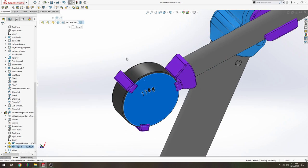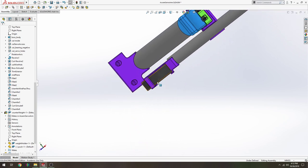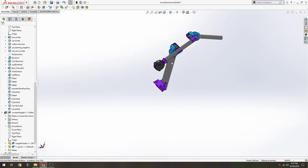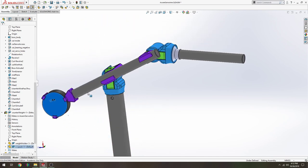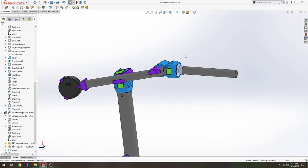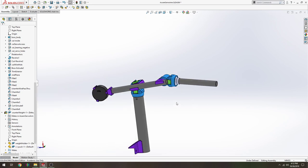And the hockey puck, standard hockey puck, is 170 grams, and you could make this taller. You can stack more of them, 1, 2, 3, 4, and you will still have clearance against your assembly, because you have to come out of this face, not the opposite direction. You'll still have clearance to swing, and that will help this servo to have enough power to lift whatever's on this end of your assembly.